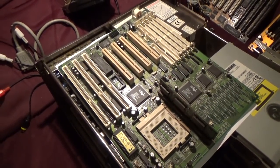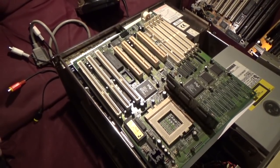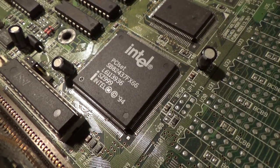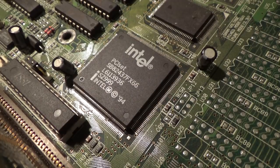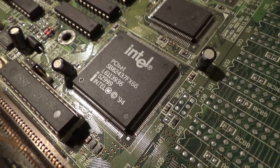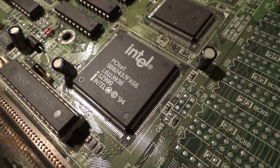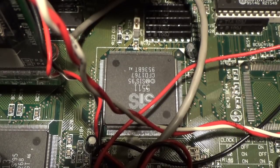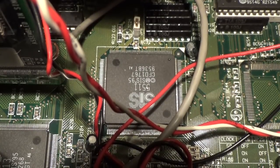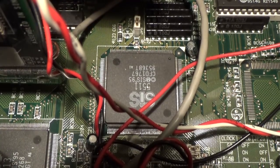And that's not a coincidence, because this is an ECS SI55P AIO. It's a board which seems to be around the same age. Their model numbers are actually somewhat descriptive, but also a little counterintuitive. The TR5510 actually uses an Intel 430FX, or Triton chipset, despite the fact it has the SIS model in its model number. Meanwhile, the SI55P uses a SIS 5510 series. I wonder if they swapped the model numbers of the board by accident. It seems to be the first two letters that denote the chipset, but yeah, the numbering is...